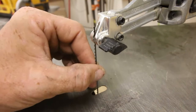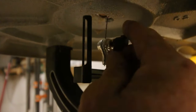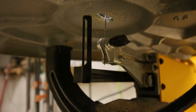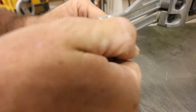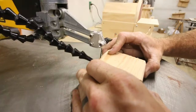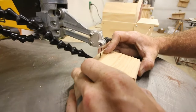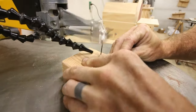Changing the blades on this is incredibly easy — it's just a series of two thumbscrews. I start by putting the blade in place and tightening the bottom thumbscrew first. Make sure the head of the scroll saw is as far down as it can go, then tighten the thumbscrew in place and re-tighten and it's ready to go. The general rule of thumb is the tighter the blade is, the more accurate it will be, but also the more likely you are to break blades, so you just have to find a balance point.